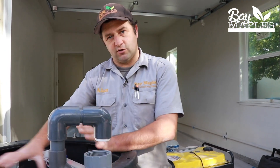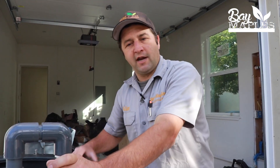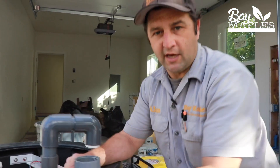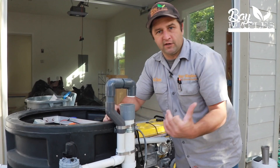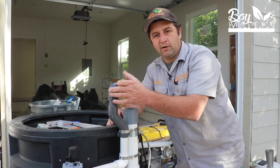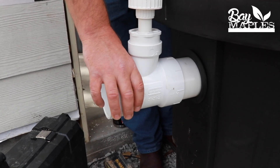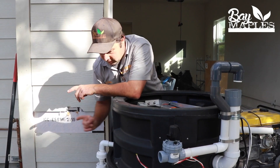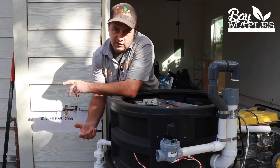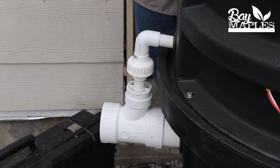There are also some initial sensors and controllers housed in here. Whenever there is insufficient gray water at any given time to meet the landscape needs, we have this potable makeup water which will take water from the municipal supply and help feed the irrigation system. This is a little air gap right here to make sure there's no cross-contamination between the gray water and the potable supply. On the far side, this is our sewer connection — so if the pump ever fails, the water can flow to the sewer. It's also connected to the filter bypass, so whenever the filter is cleaning itself, it'll send that dirty water back out to the sewer.